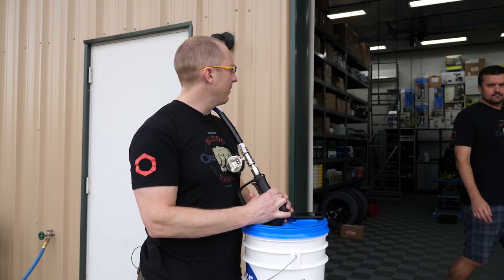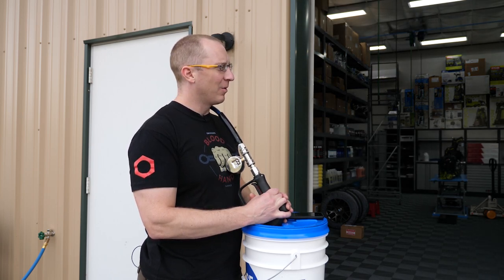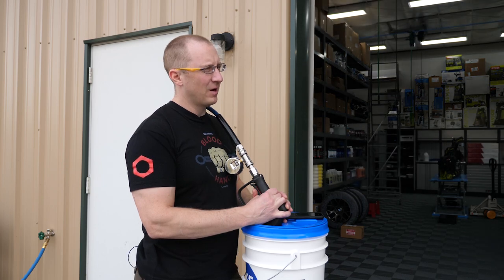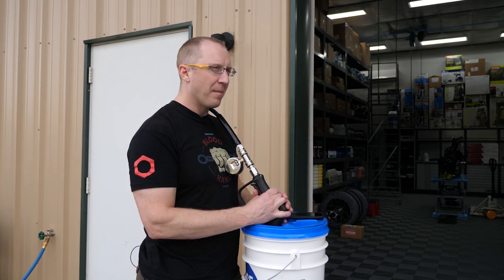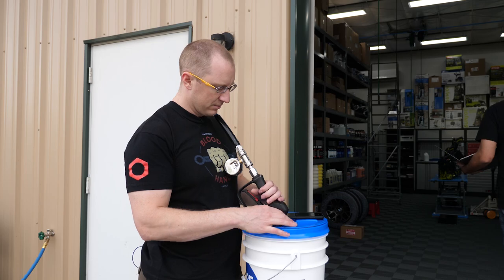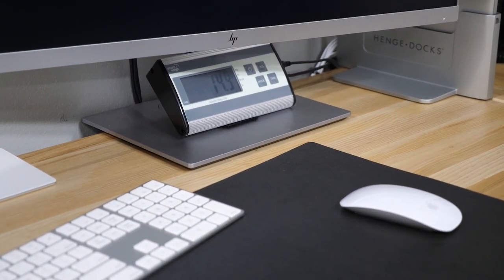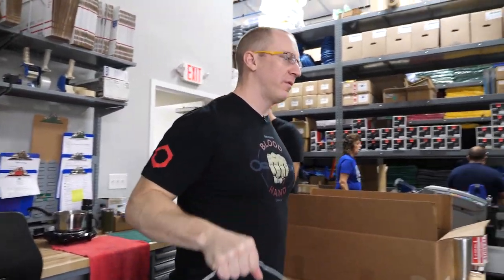We were drawing 15 and a half amps before — now with the 3.0 nozzle we've got 12.8 amps. So we've made it more viable on a regular circuit, but I wonder if we're working the thing a lot harder now that we don't have the back pressure. I'm reading 72 decibels. And the flow result is 1.45 GPM.